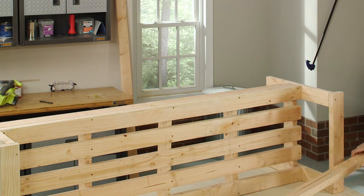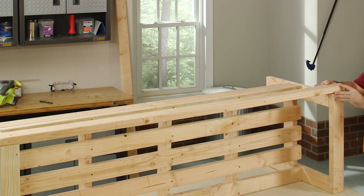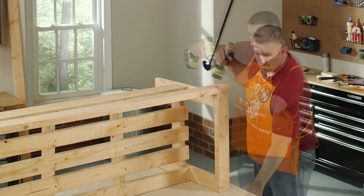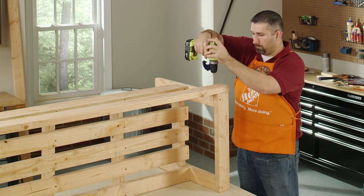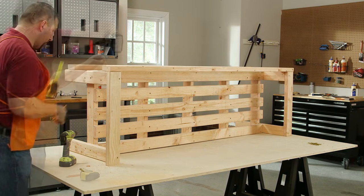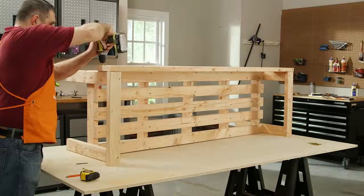Next, lay the sofa down. Align the 79-inch top backboard so that it's flush with the top of the handrest. Pre-drill and attach with 2 screws on each side. Measure 1.5 inches below this top backboard and pre-drill and attach the 75-inch backboard.